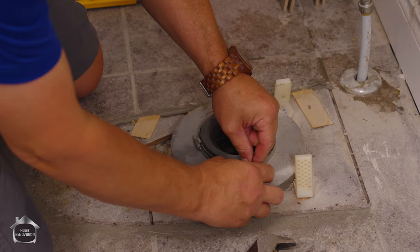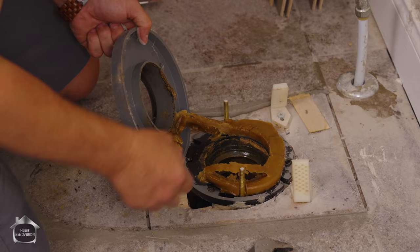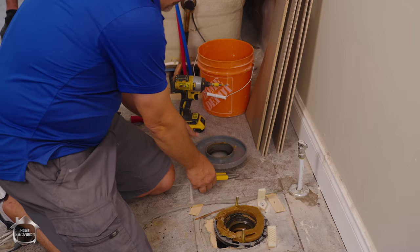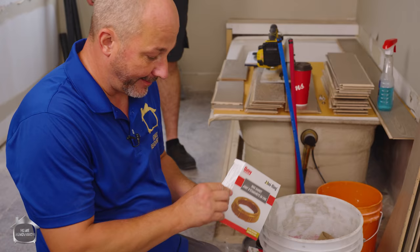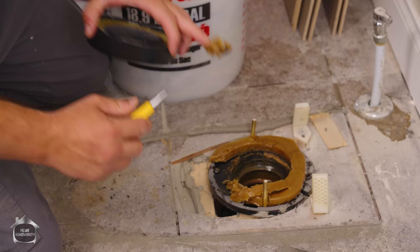This particular toilet comes with installation instructions for this unit. This one sits on the wax — it's a really traditional wax ring. Here's the wax ring I used in this situation — it is one inch thick, and it gets compressed to make a really good seal. You can see it is no longer one inch thick.